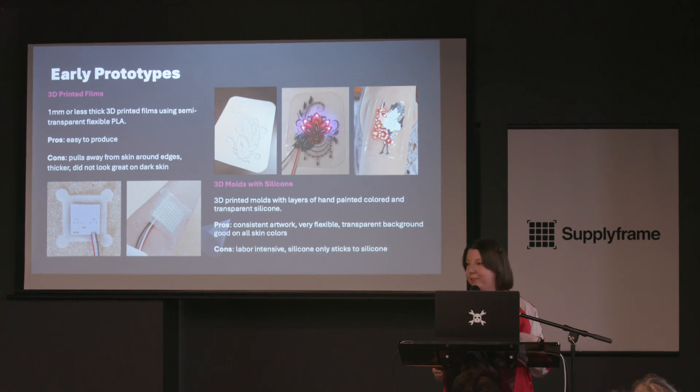I was also playing around with LED matrices before going a more artistic route, using 3D molds with silicone. I would print a piece of artwork as line work, then in that mold paint black silicone, clean up the rest, put clear silicone over it, flip it over, and like a coloring book fill in the outlines with colored silicone. A circuit board would lay underneath. This was cool because you could get clear silicone on top, which allowed any skin tone underneath — I really wanted this to be accessible to a lot of different people. But it was insanely labor intensive to paint the artwork, and if you've ever worked with silicone, the only thing that sticks to silicone is silicone. You had to use a silicone-based adhesive, the electronics risked sliding out from underneath, and it was extremely problematic — but I stayed with this for a long time because it was working.